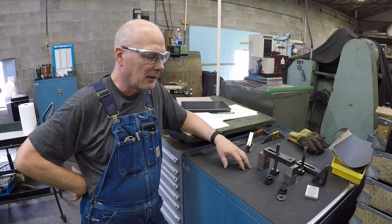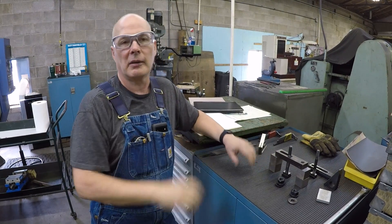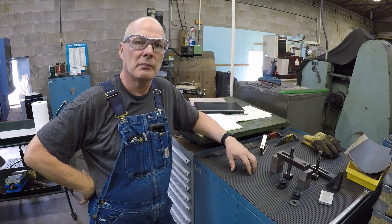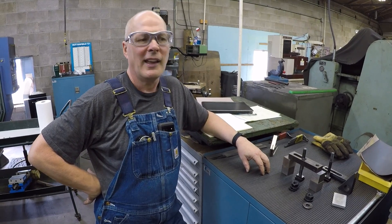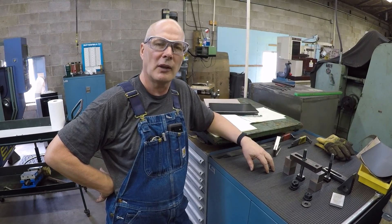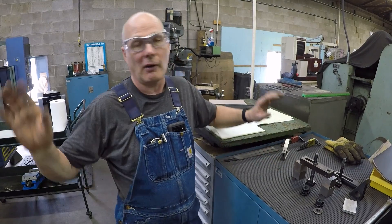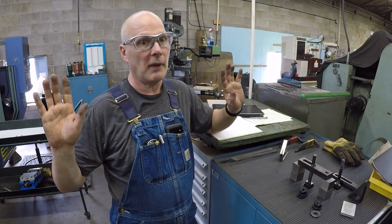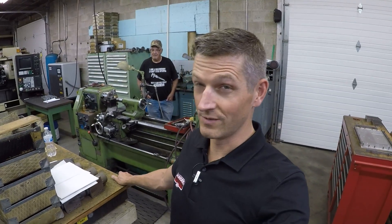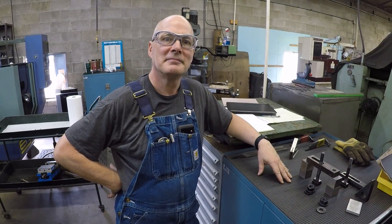In this trade it's all about the dirty little details — if you don't pay attention to those details you end up with crap. This is particularly important when cutting thin parts or trying to avoid distortion. It amazes me even today how large a piece you can get distortion in — you think it's so thick and it's still distorted. Over the last six months building fixtures for our tombstone on our horizontal, we've been putting indicators on fixtures all the way up against cast iron, and even one of those mighty Uniforce clamps opening up causes the whole fixture to bow out — only a thou or two, but I care about that.